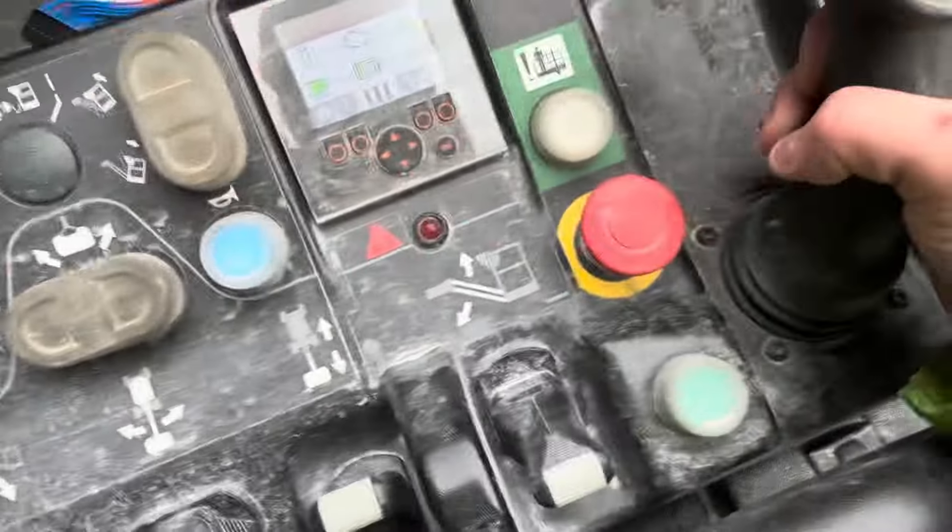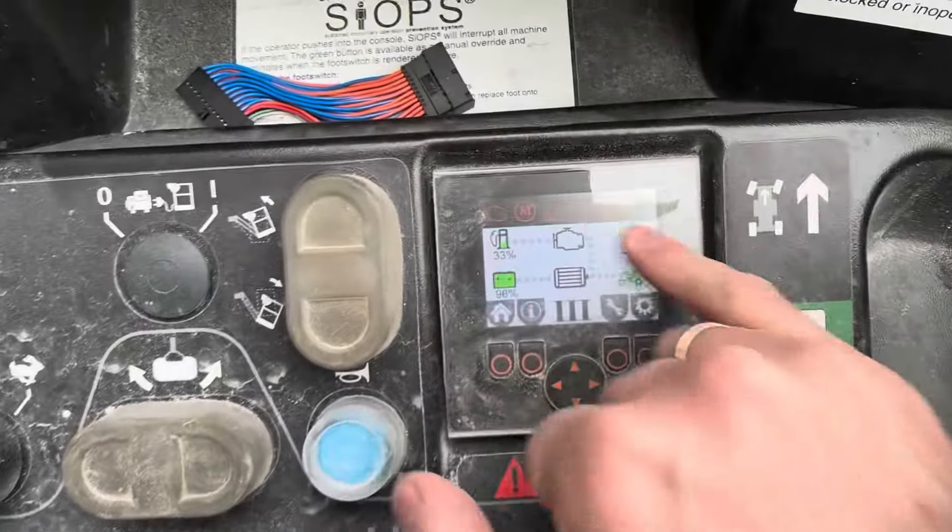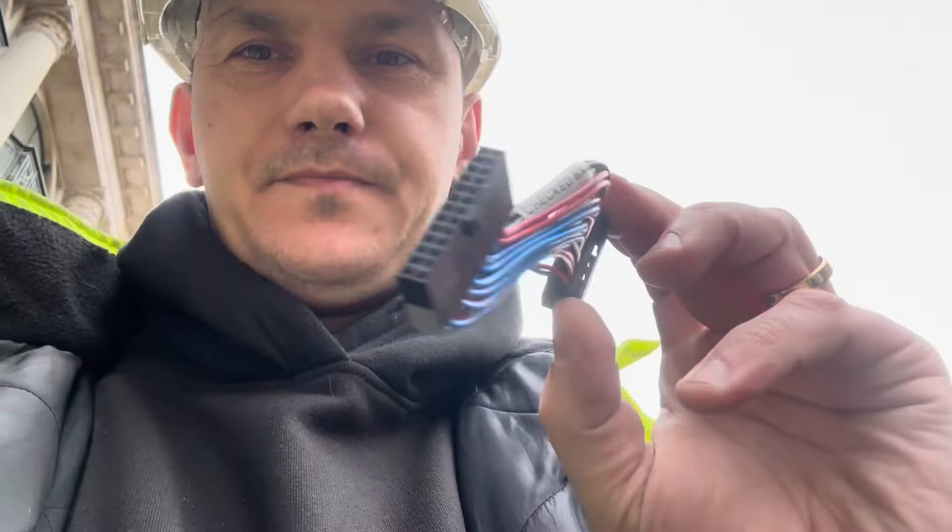I'm going to try to do the same thing, but this time I'll leave the joystick disconnected and see if that brings up any of those errors again. I have restarted the machine with the joystick adapter disconnected and at the moment I have only one error code: 01C2-0020. Let's see what that means.